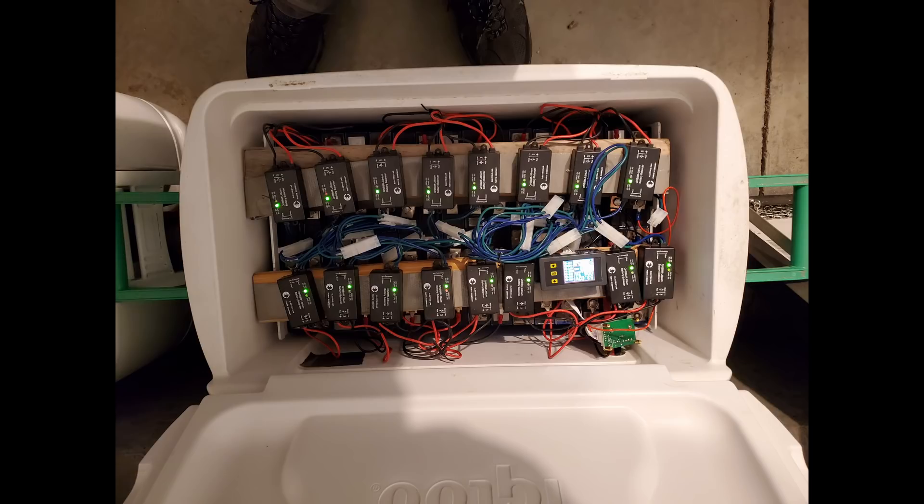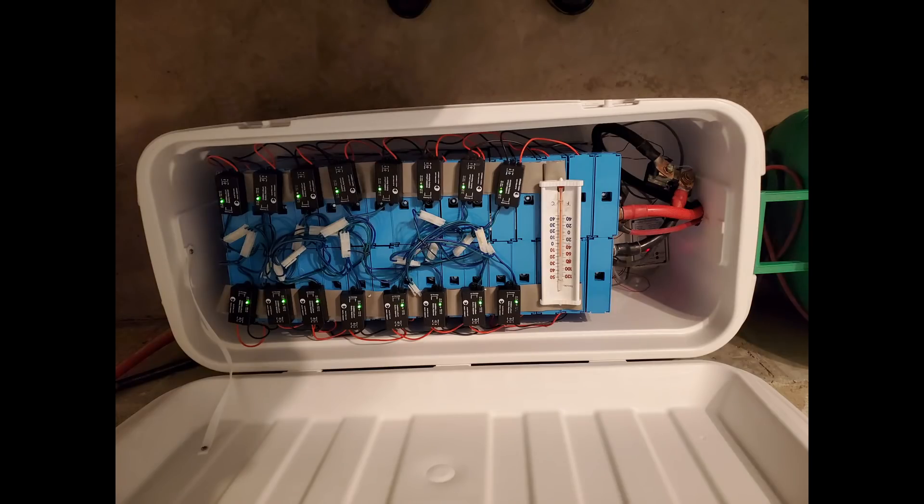Even with that, I had to keep the voltage between about 3.2 and 3.4 volts, or the resistance on some cells would have overpowered the equalizer and either over or undercharged some of the cells. Amazingly, the batteries have been working great over the last year, cycling about six kilowatts every day. I made a second 10 kilowatt hour LFP battery with 32 100 amp hour cells — the same cells I used in the Ultimate Junior. Total cost was $4,100, which is a lot cheaper than most people pay for a battery of that size. Both batteries can usually power the house all night.